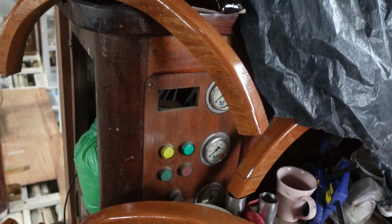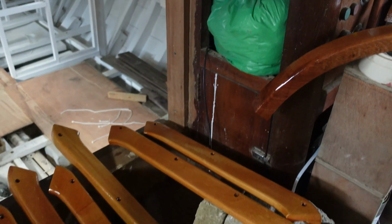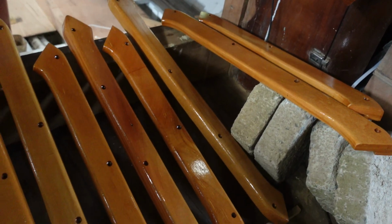Nico has also done an amazing job at varnishing everything for the windows. So the whole window frames, that's going to hold the windows in place that Nezel and Diego made. So he's been varnishing that. It's got 10 layers on the outside and it's got 4 layers on the inside where it's not going to be in contact with the sun.